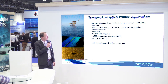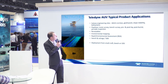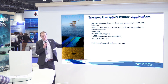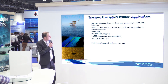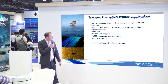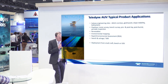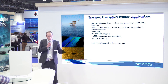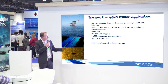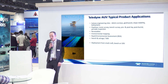So we have a low logistics AUV with a multi-beam, and I think that opens up opportunities in subsea engineering surveys, debris surveys, geohazard surveys, pipeline surveys — as-laid and trenching surveys. Also in renewables, where we see a lot of activity. In renewables you're typically working at around 40 to 50 meters of water and you can come really shallow as well. With an AUV you have that opportunity, deploying from a small vessel, from a beach, or maybe from a larger USV.